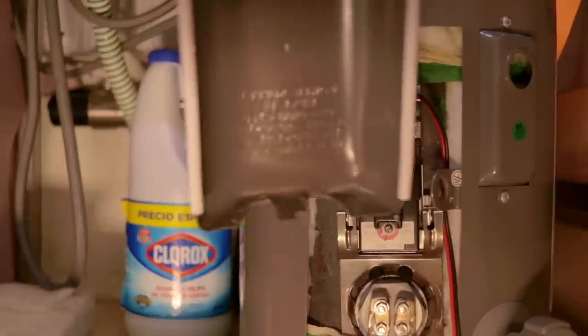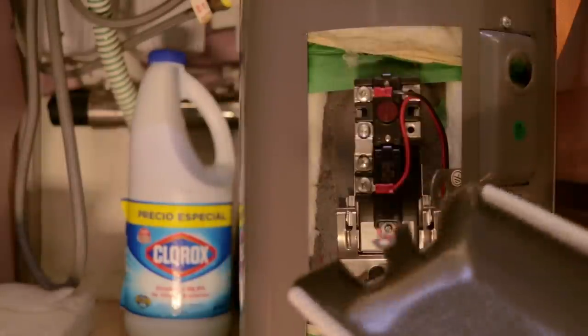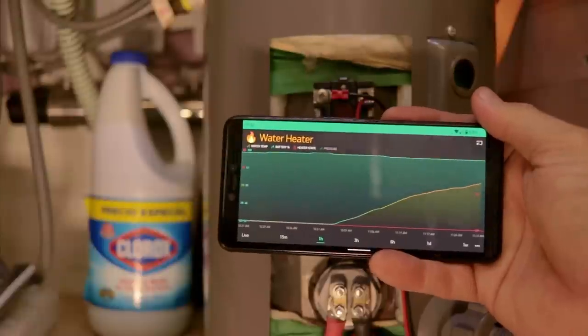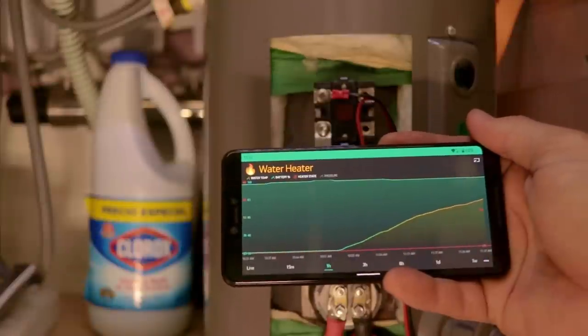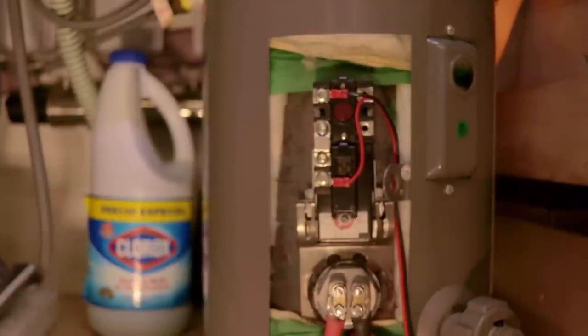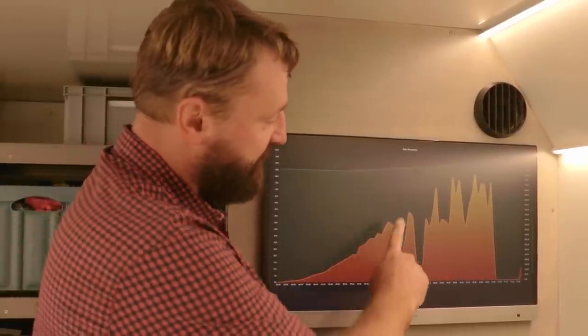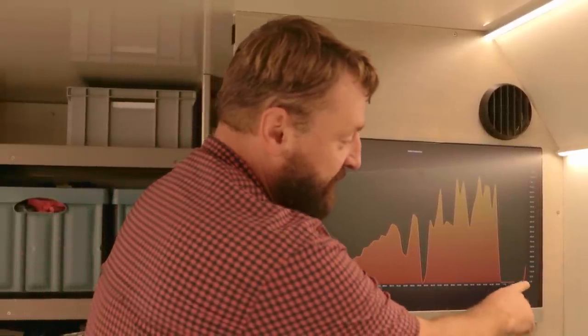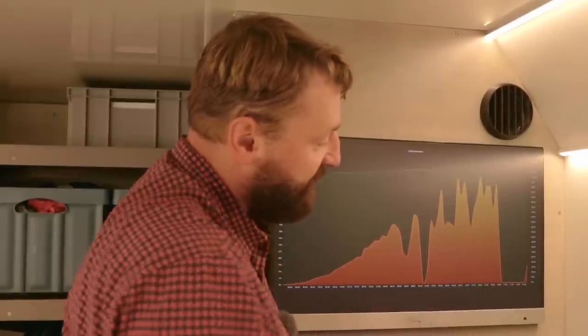I also made some access holes at the bottom to fit around these large welding cables. It just clicked off — it has taken about 10:56 to 11:30, a little better than half an hour, to reach set point. That's going to fluctuate with sun and cloud conditions, but that's pretty good. Test completed. Everything seems to work very well — none of the wires got hotter than expected. The hot water heater got up to temp nicely, even on a sun-and-cloud gloomy day. Our solar production was fluctuating throughout the day, then dropped off as it was heating the hot water heater. Now that it's back up to temp and the battery has come down a little, the solar is on its way back up.